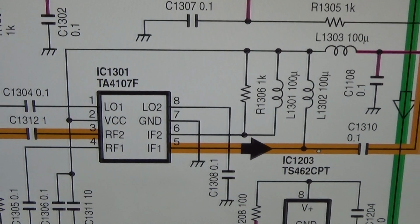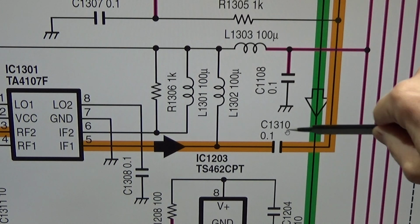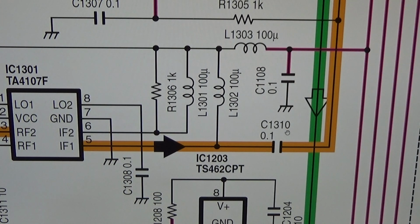And now you see why you really get a transmitter power drop, because the C1310, which we have seen as cracked, is here a coupling capacitor. And of course, if the coupling capacitor is broken, is cracked, then it is clear that the signal will drop. At the time we were searching for the problem, this little capacitor was sitting somehow in its place, and it made intermittent contact.